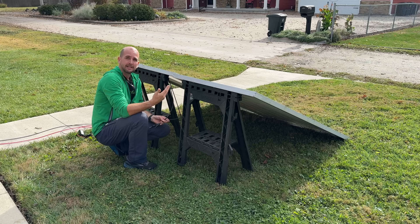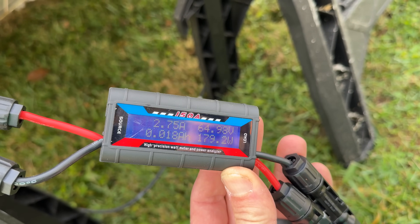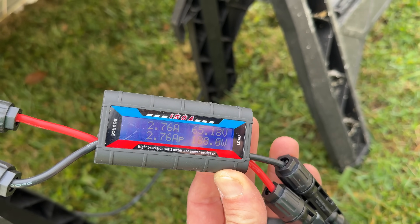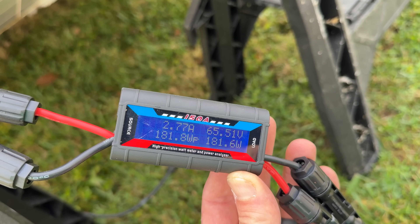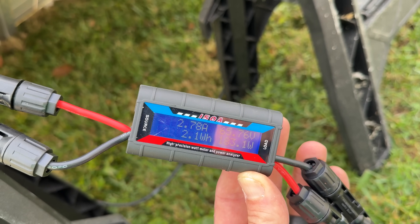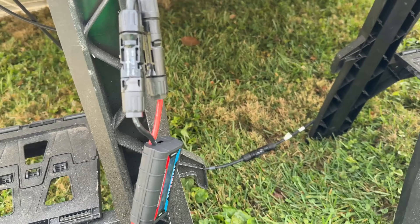The voltages we'd expect are now somewhere around 66–68 volts, but the power actually goes up by more than a factor of two. We can see the voltage is at 65 volts, and as you'll notice, that has now allowed our current to go up by about double as well. So we have now quadrupled the overall power we're delivering to our cooktop, and hopefully this will get us to the temperatures we need to see how much energy we actually have to put in to get one liter of water to boil and make our ramen noodles.